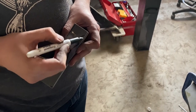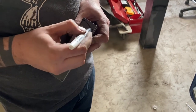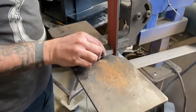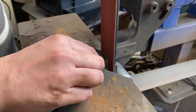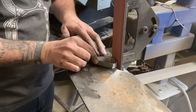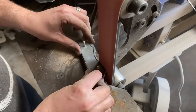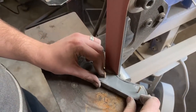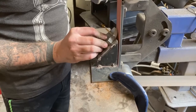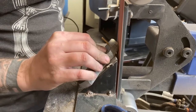Then you can draw in by hand the front face. Now sand down all the excess material and just get it close. We are grinding this side down on an angle because that is where the handle material will come down and meet up with the blade surface. It will be a lot harder to clean this up after the handle scale is on the blade.